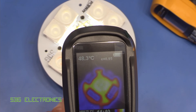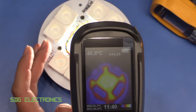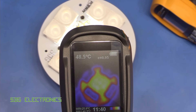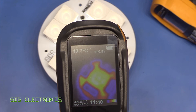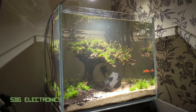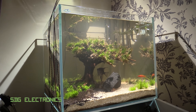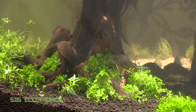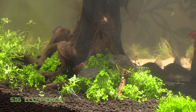Looking at the thermal camera from the front, the LED lenses on the coloured LEDs are blocking some heat, but you can see it's most intense in the centre, transitioning to a reddish colour towards the edges. That looks pretty good — even at slow fan speeds it should stay nice and cool. This is how it looks over the aquarium at around 30 centimetres, which is what I designed the optics for. Raising it up changes the effect and increases light spillage on the wall, but the colour is really spot on — the greens look really true, and that 90 CRI is having a really nice effect. I'm pretty happy with how this is looking.